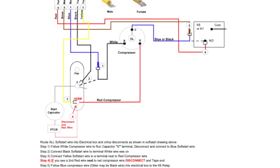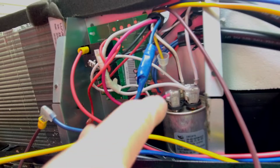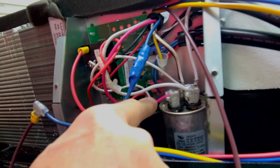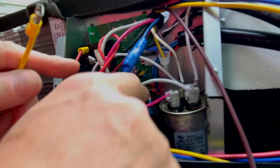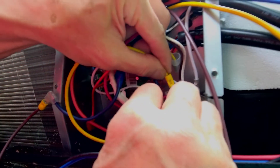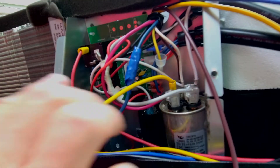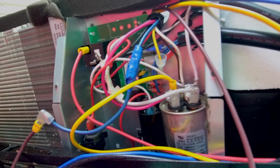Next, the schematic shows what we're going to do with the yellow wire. You can see there is already a red wire going onto the HERM terminal — the hermetic terminal — on the capacitor, and there should be a spare place in the back. We're just going to connect it right there. Yellow wire done — we're just going down by colors. We've run out of wires, so we must be done!